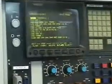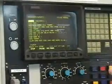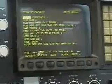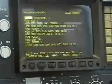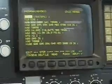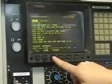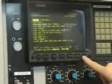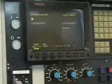Now, when it's in this special auto mode, you can punch the file out and not even worry about it. It takes the O number and creates the file, and you'll see that it's actually received it, and it gave a message, although you may have missed it, saying that the file was received, 3121 was received, and it goes back to the light. Now what I'm going to do is delete program 0, right, because that's the one I'm using to see what's happening, the remote directory, and all I do is hit read.